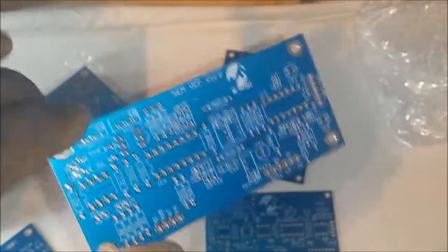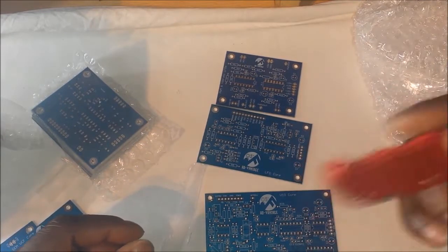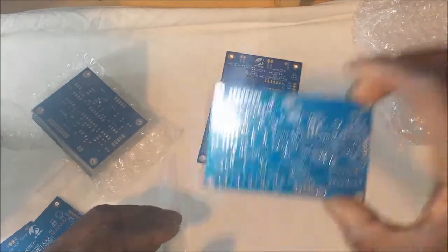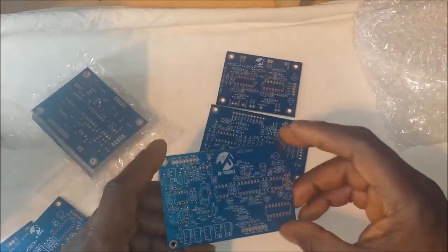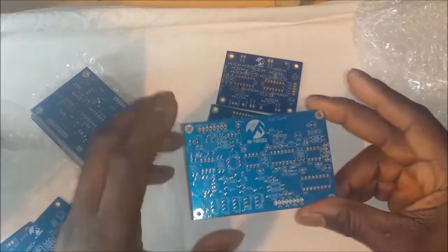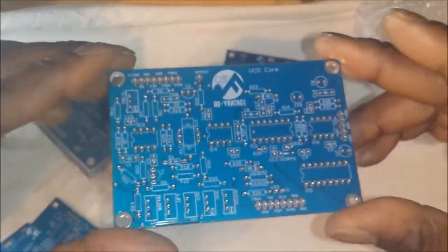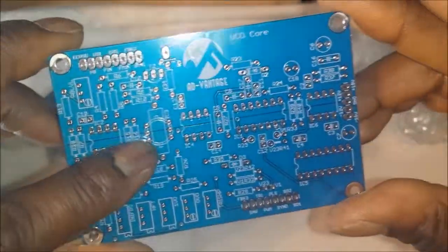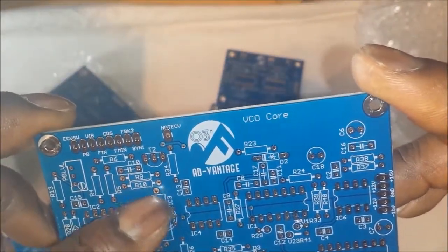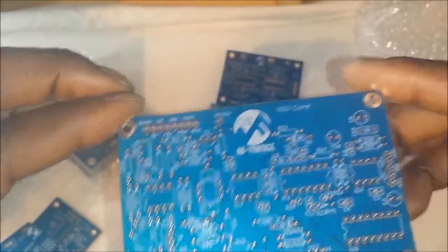My plan is to put these in the first system I'm going to build, which is the Advantage O3. If I decide to do a cut-down version, I can basically use the same PCBs but with a different layout — for instance, a two-oscillator version, maybe one with three envelopes, or one with two SEM type VCFs or the Steiner Parker. This is the first batch I'll be populating. Let's have a close-up: that's the VCO core, and that's where the expo transistor pair goes. The temperature coefficient resistor goes underneath there, and that's the back of the board — really nicely done silk screen. I'm really pleased with the outcome of these.